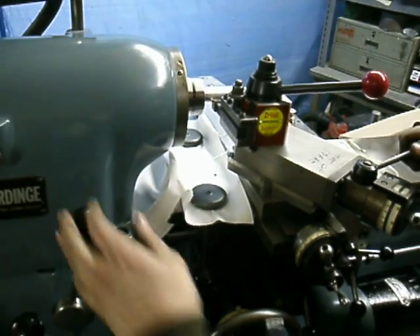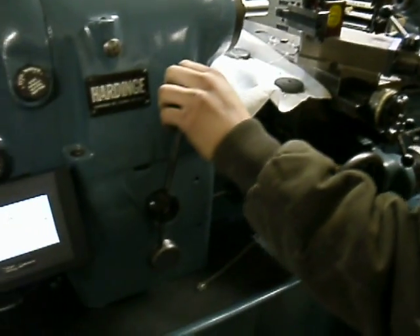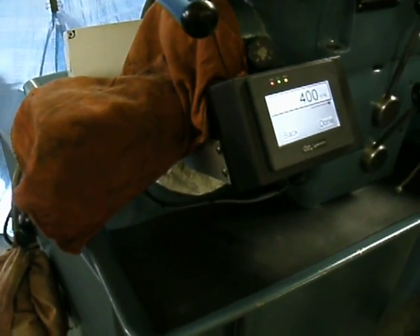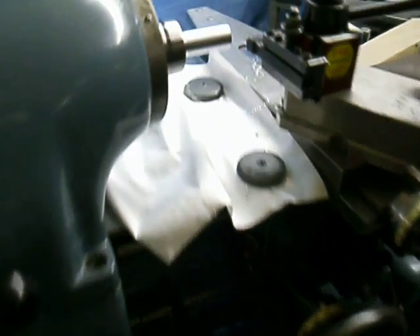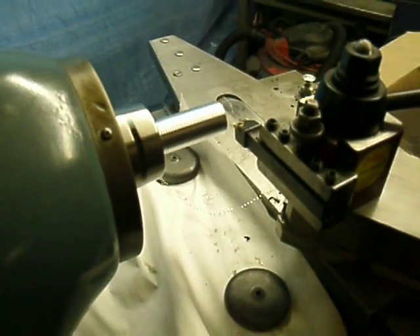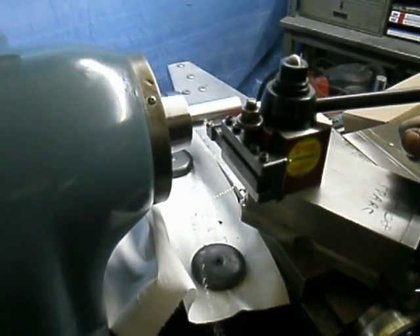This is not cutting mechanically — it's cutting purely via electronic lead screws. Repeatability is plus or minus one thousandth of an inch.